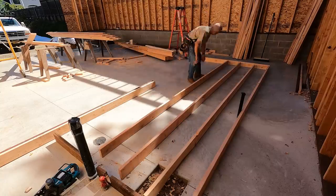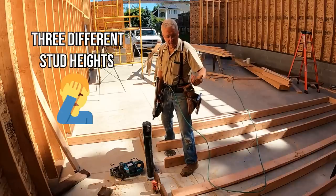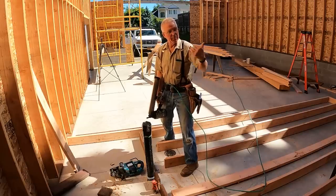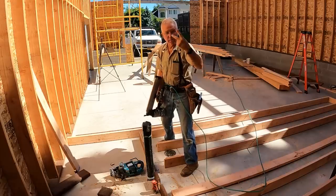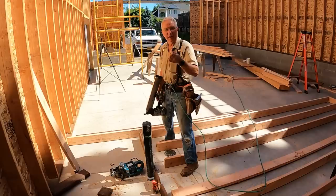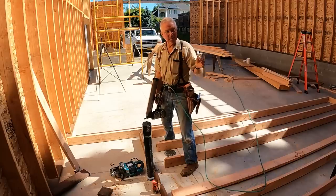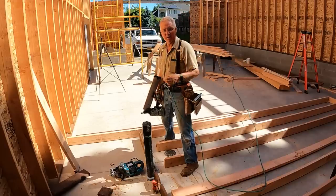I'm finally ready to bang together a few boards. I have four different stud heights. I've got some doorways that are squishy so I have to use a thinner trimmer. I'm dividing the overhead clearance distance in this loft area in two, so it's a non-typical stud length. Seven foot six around here is the minimum ceiling height in a living area, and I'm going to end up with about seven foot seven, both downstairs and upstairs. But I better get that right.